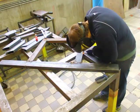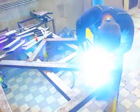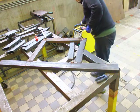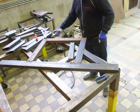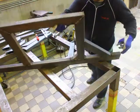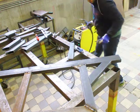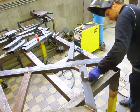I'm using 80x40x3 millimeter steel tube on the bottoms, and the top rail is 100x40 millimeters — they are pretty hefty tubes. Since the Hiwin linear rails are going to be mounted on the sides of the top rails, that guarantees it's going to be a good, strong mounting surface and it's going to work pretty well.